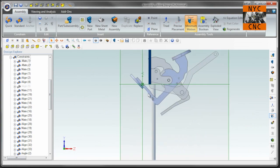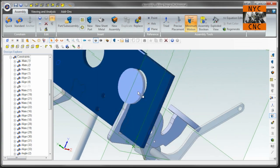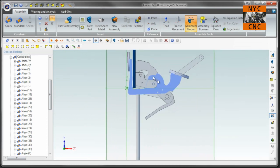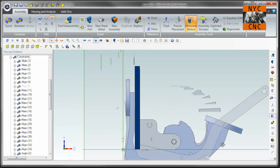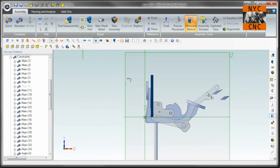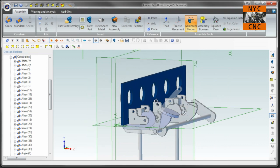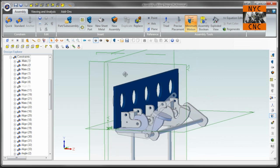For instance, one of the things I've changed is I used to mount the hit target flag on the outside of the post, and that's not really practical. So now what I do is I mount it on the inside. I didn't actually change the CAD file, but you can see the other target ear right here has room for that 100 thou piece of steel in between the two, whereas this one would not, because it was designed to go on the other side. So you get the idea. Likewise, it's been helpful to design the reset bar. A lot of tweaking in the design and perfection of getting that to reset correctly, to feel right, pull right, and work functionally out in the field.